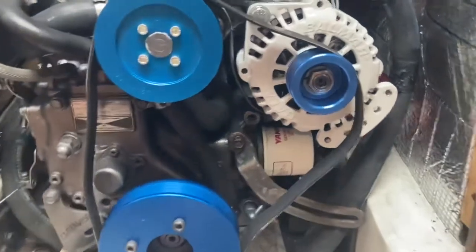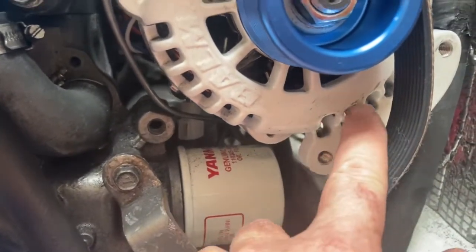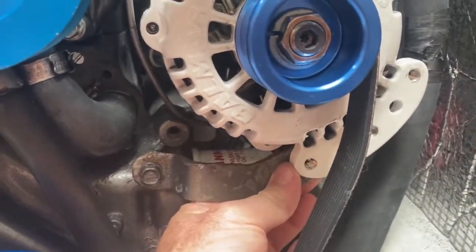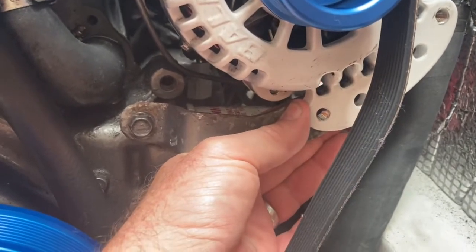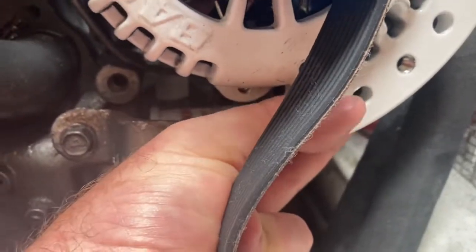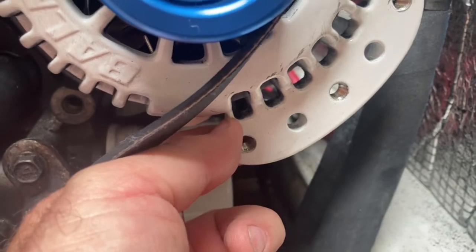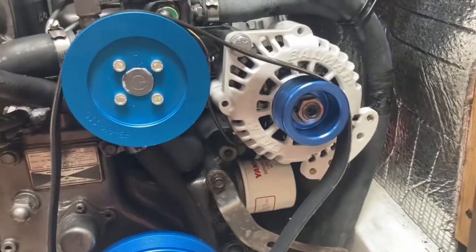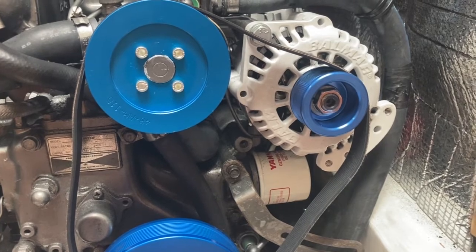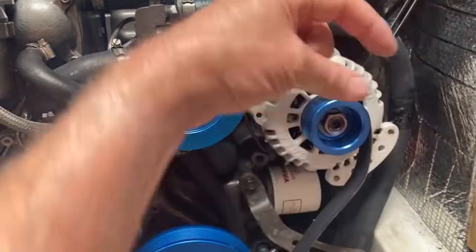Here's an update. This last hole right here, which is threaded — because of the shape of the housing behind this, this piece of metal won't allow an alignment of the nut through the hole. So the only solution is to put a nut and bolt through this smooth bore hole to hold it. This is going to be a temporary fix. I'm trying to see if I can get a smaller, shorter belt — this one's 40 inches. I'm also probably going to splurge and get what Balmar sells called an alternator buddy, which allows you to adjust the tension by turning a bolt.